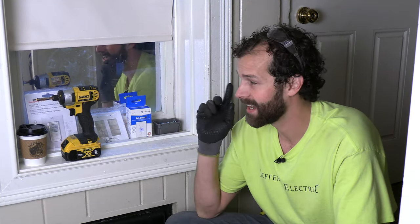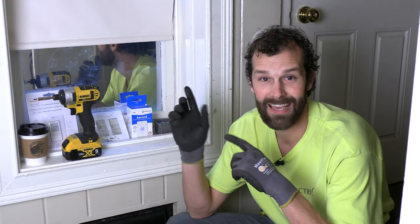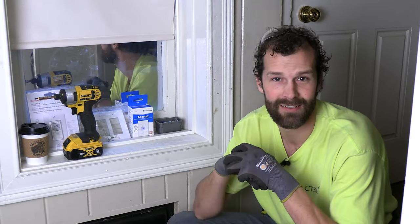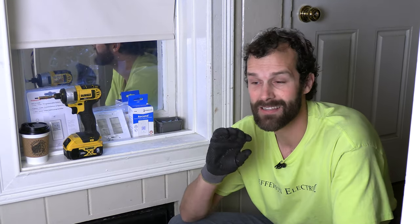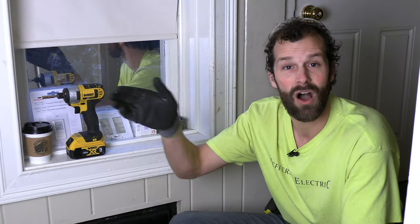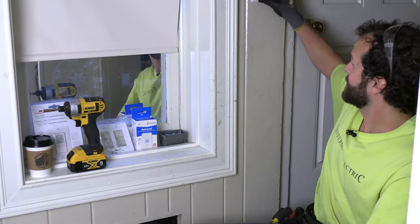For today, I've got a back door right here. This comes right into our mudroom. We park our cars outside and I need to add a lighting control. In my humble opinion, every outdoor security light or convenience light needs to be on some method of automatic control. That's not a code, that's an opinion — automatic control so that it's on at dark, off either at midnight or at dawn, whatever the case may be to satisfy your security concerns. But a manual switch like this to operate an outdoor light, it's a no-go.